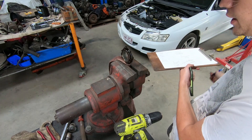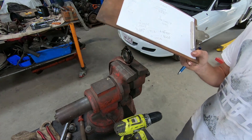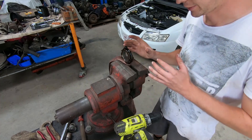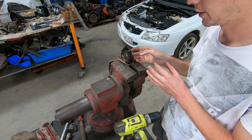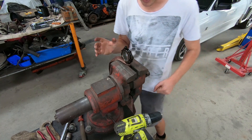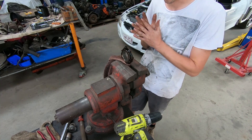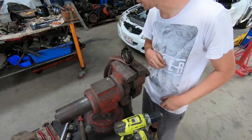This is what you repeat time after time to get all your clearances right. As I said, it's a very very time-consuming process — and that's just for the rod journal. You do the same with the main bearings on the crank as well. Given this motor was running with these bearings in it, after doing one I just wanted to show you how to do it. I'm putting new bearings into the mains, so I'll do one of those for reference. But I'm pretty happy with these rods — I'll just transfer all the bearings, put them back together, and put them in the motor.